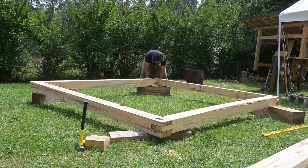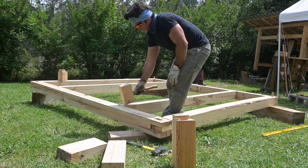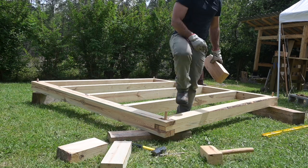This also works for a drop-in, so if you had a mortise over here, you could drop it in like this. So like for joists, this is going to be pretty good for your pergola builds, gazebos, pavilions, even floor systems of cabins. This is a pretty beefy joint.